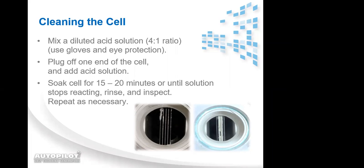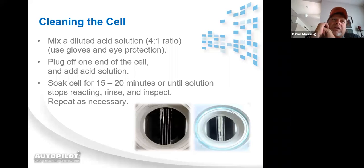So the other question we had is, what causes those calcium nodes or buildup on the bottom of a concrete finish pool, a Diamond Brite or a similar finish? You get those little calcium lumps. Okay, it's basically that your water is out of balance. You almost have to look at water like a living creature. It wants to be happy. So water has basically three forms. It's either acidic or alkaline, it's neutral, or it's scale forming. So to find that out, you actually have to run the saturation index.